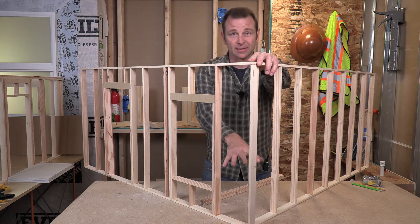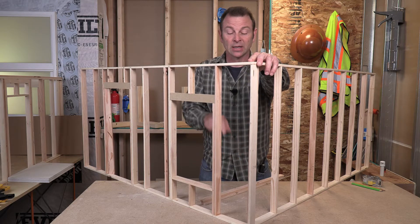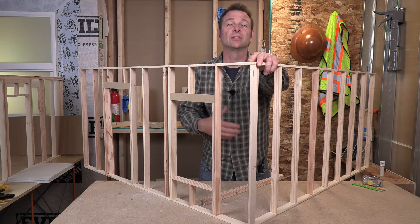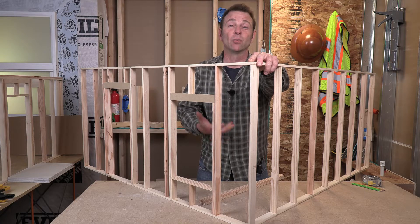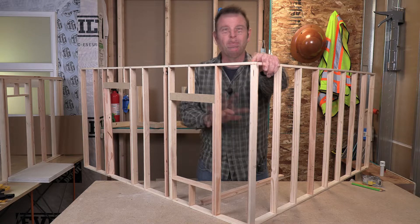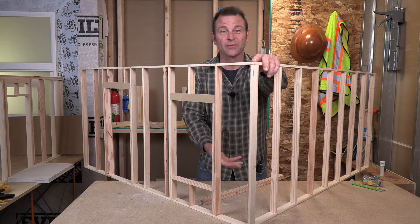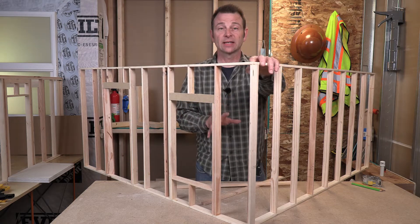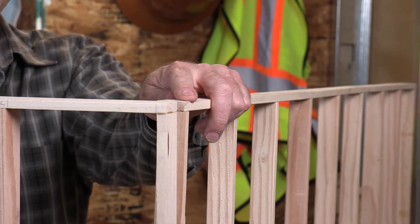One is going to be at the bottom — we need to make this connection here. That's the easy part. Our bottom plates are easily connected to a concrete slab using bolts, that's the common way to do it. Or if it's a wood deck, we will nail this down frequently. So the bottom connection is always sturdy based on this idea of platform framing — we're always connecting these to a deck. The next thing to worry about is this top connection.